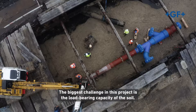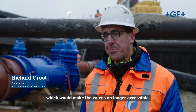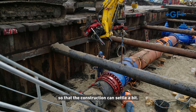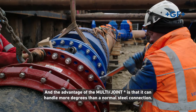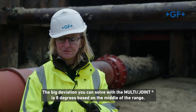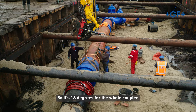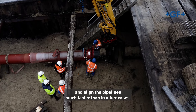And for that we use a great many couplings — specifically these couplings to connect the HDPE pipe with the GF multi-joint couplings. The biggest challenge here is the ground. The structures are on high piles, purely to ensure that the underground conditions do not affect them. But we also need transitions that can follow a certain settlement. The advantage of the multi-joint in this case is 16 degrees of angular deflection for the coupling.